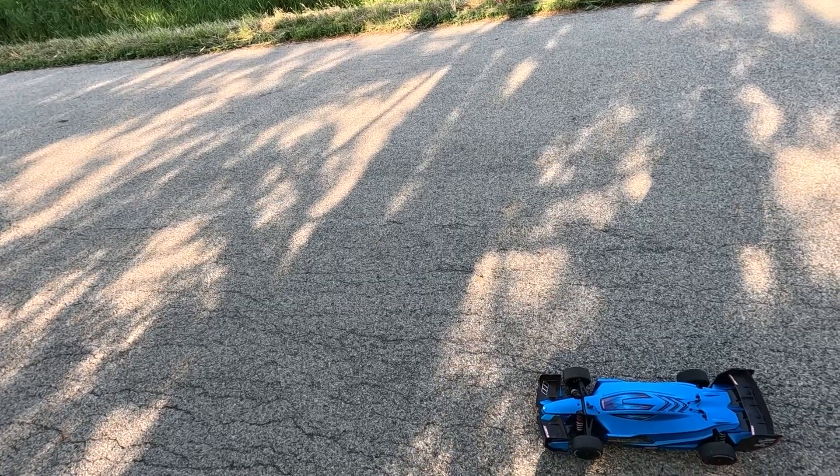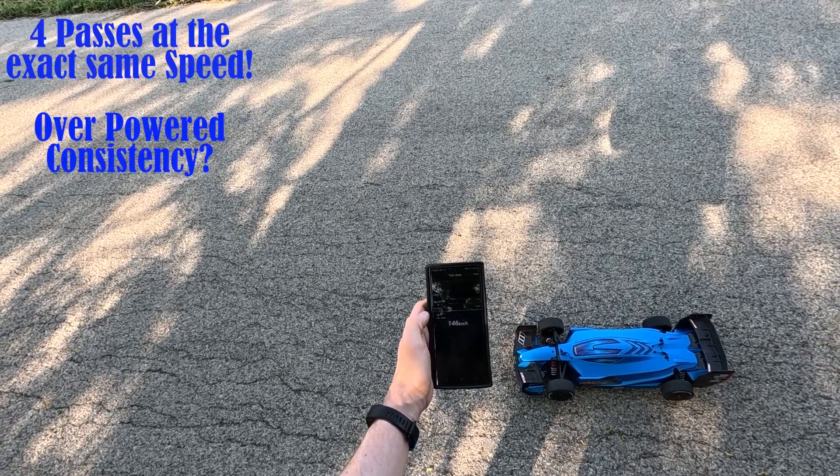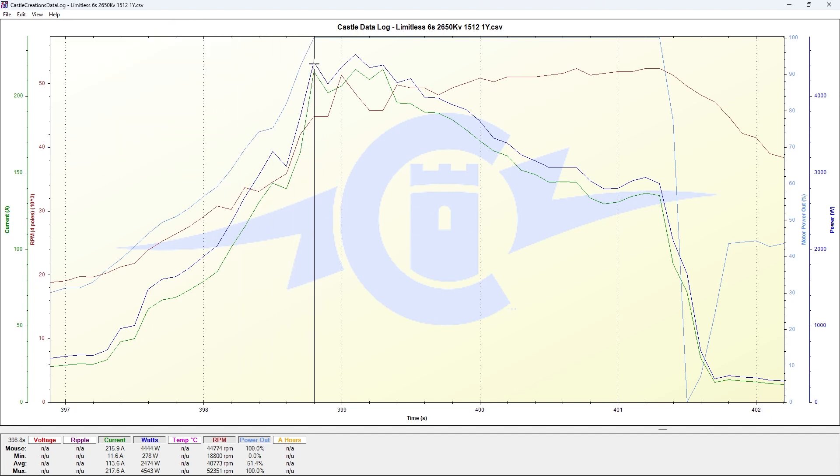After another pass, here's the data we were able to collect. Looking at the graph, at full throttle we pulled a maximum of about 205 to 215 amps — a little lower than expected. At the end of the full throttle run, maximum RPM came in at 52,300, which is very close to the 51,800 we calculated. Current at top speed was 135.7 amps. Hopefully knowing these things gives you an understanding of the risks, what can happen, and why. If you're planning on overvolting your brushless motor, keep these factors in mind. Thanks a lot for watching — see you in the next one.